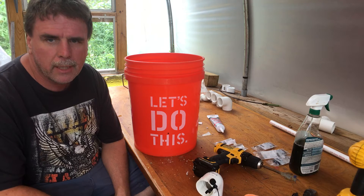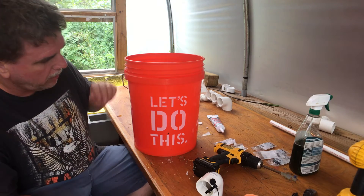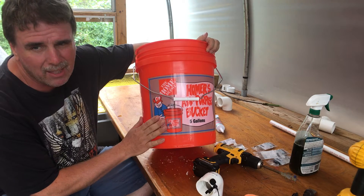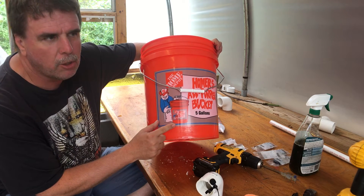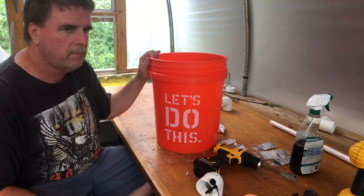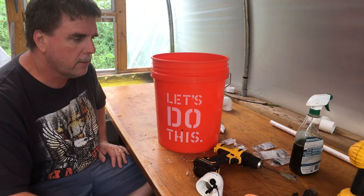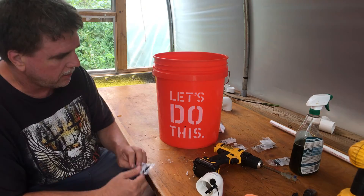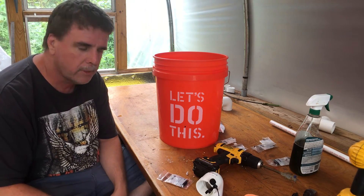The kitty litter buckets seem to be working really well. The square edges seal better with the o-ring than round buckets, but if you can't find buckets, just go to Home Depot, Lowe's, or Walmart. I think the blue Walmart ones are about $2.50 — the cheapest you can buy — or about three dollars. A commercial Bato bucket is about six or seven dollars. I moved my hole up to four inches to allow for the slope of the drain. With round buckets the o-ring doesn't always seal, so it's worth putting a little bead of caulk around the outside just to make sure.